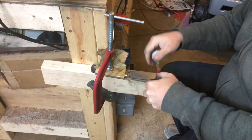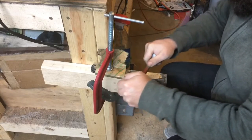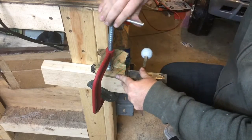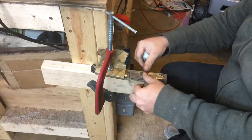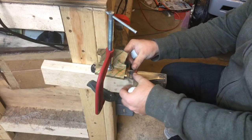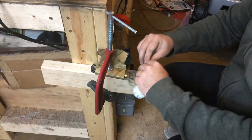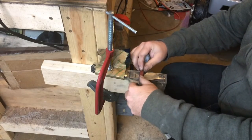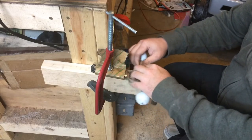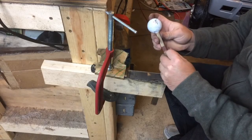Some guys when they're hand sanding like to kind of change direction — that's done really easily with these handles on it as well, so you can get a different angle however you need to. Looks like I didn't tighten my clamp up. But obviously as you clear one side or clog one side up, just turn it. You probably want your bottom edge trailing, so you can kind of turn it as you need it. Flopping those last edges gives you one last shot at it.